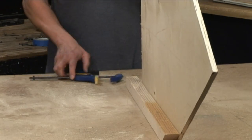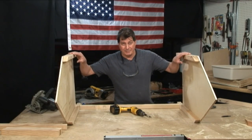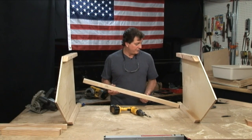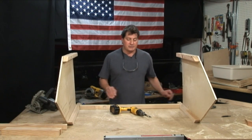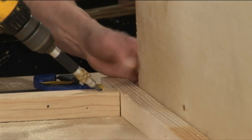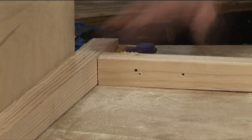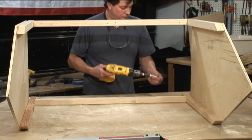Use a quick grip to help stand it up — it makes the floor beam easier to install. Now that we have our legs mounted to the side panels, we're ready to cut two pieces of 1½ by 1½ by 38½ inches. When put in place, that will give us an outside dimension of 42½ inches. After your screw is in, you should have a nice snug fit. For this pilot hole, start it straight, then angle it in nice and slow, and come back and put in your screw.